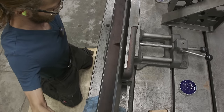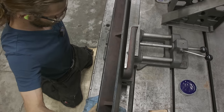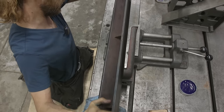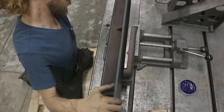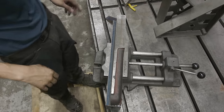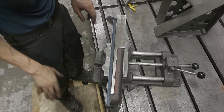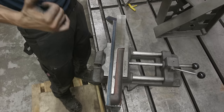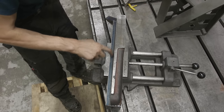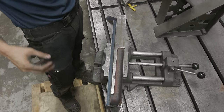I've been using this quick-release vise to hold it up. Getting a good position is really important — we want to make sure we're not rocking it too much and that we have nice even pressure so what we're seeing is accurate. Not bad for a first print overall — we actually have pretty good coverage. That step scraping works out really well: when you do it properly it really increases efficiency and cuts down on a lot of effort in the first print. We actually have really good coverage overall and decent points per inch as well as bluing along the whole surface.